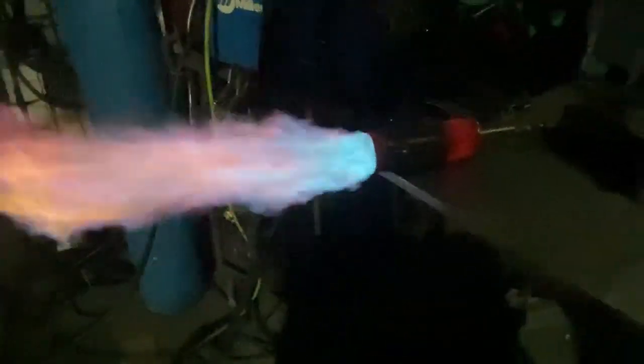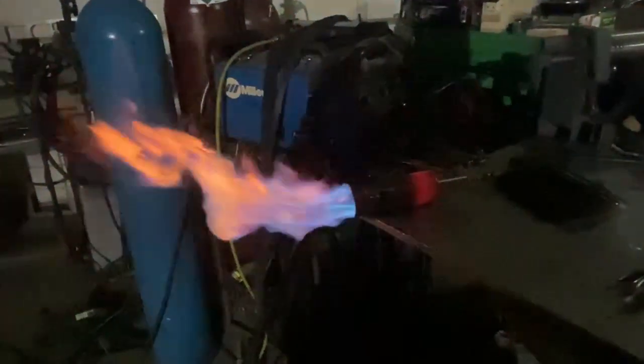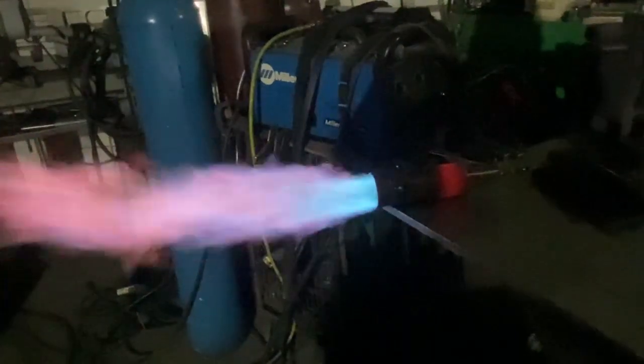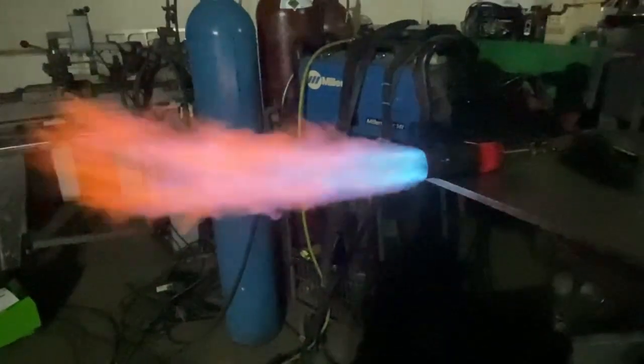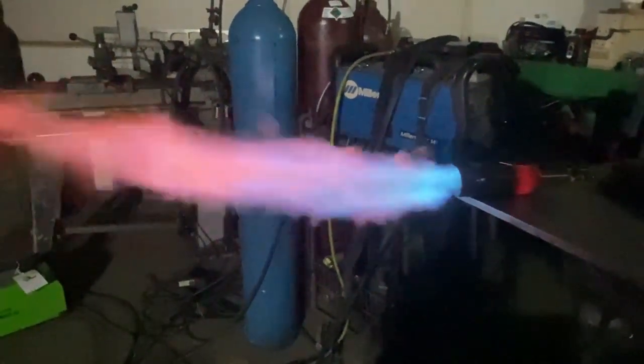That's what I need to get this vaporizer coil to work — we can see that small flame in the back. That's what I'm talking about right there. We've got plenty of heat now back in there; that should vaporize plenty of propane. Definitely what we want to see. I don't like the flame so much — it's not as tight as it could be. We'll do some changes, but the fact we're getting the back going red hot now means we're headed down the right track.